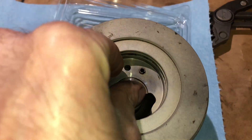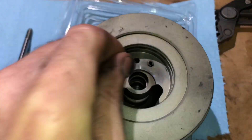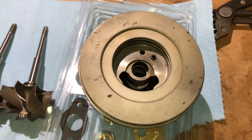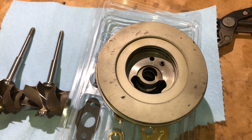Another thing to mention is that the bearing housing has to be cut for the clearance of this collar. You can use a Dremel to do that. I use my CNC machine because it's a lot easier. I'll also link to a video that shows how to cut this with my machine.